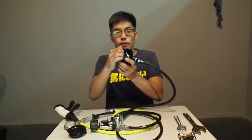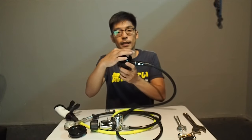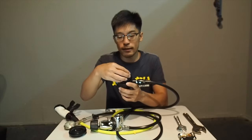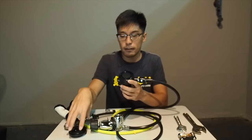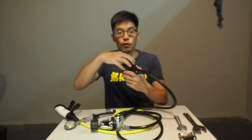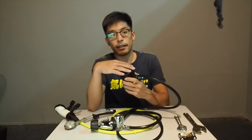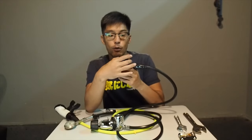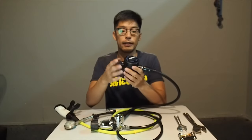What we do is remove the diaphragm together with the cover, wash it, rinse the inside to clear off any sand or salt sediments. When done, you can easily put it back. Just make sure you don't lose any parts and everything is back in, otherwise you might have a defective second stage.